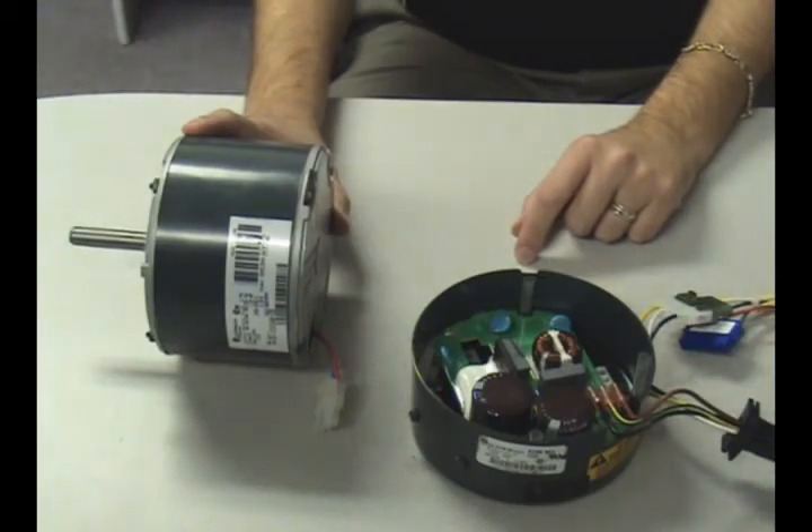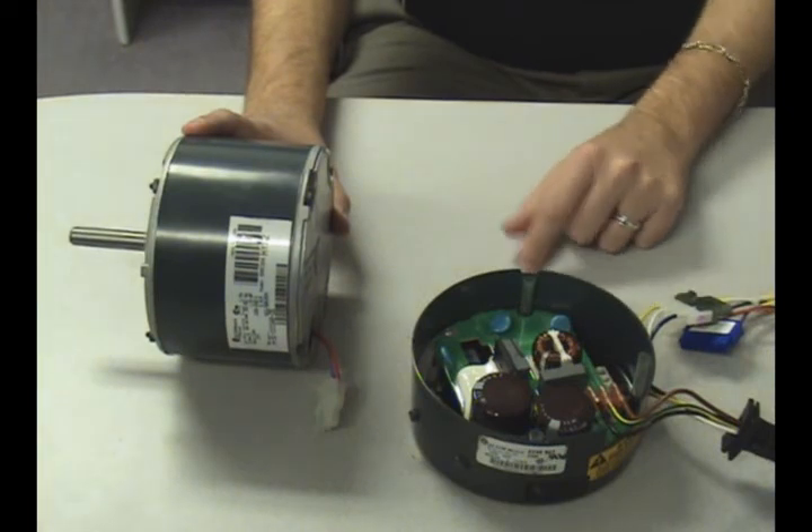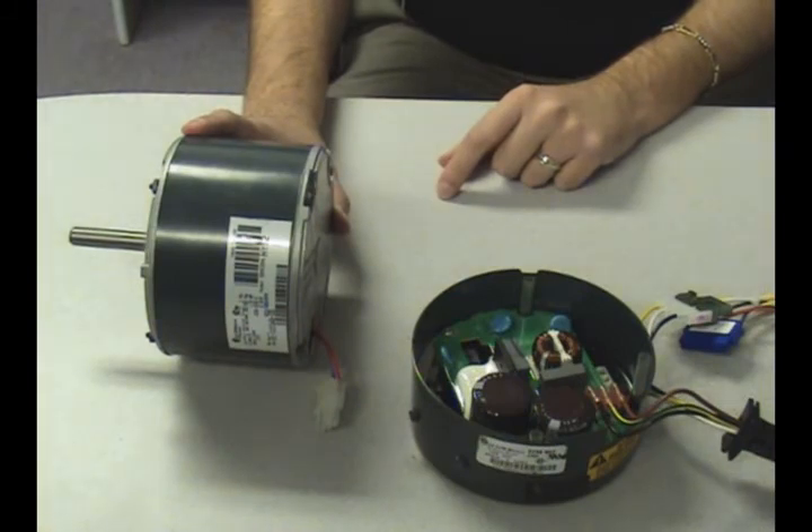Reassemble the motor, noting that the slots built into the curved metal shell of the module must align with the tabs on the metal of the winding section. Tighten the bolts. Clip the alligator clip on the red wire to a 24 volt low voltage hot terminal — do not allow the clip to touch any voltage higher than 24 volts, as it will instantly damage your VZ7 and possibly any motor or circuits connected to it. Reapply power and test the system and motor as described previously.